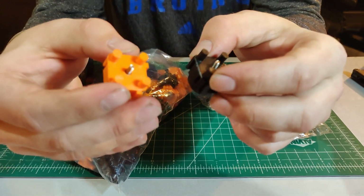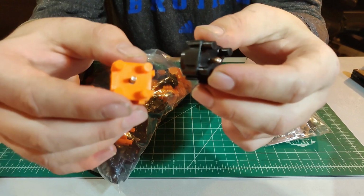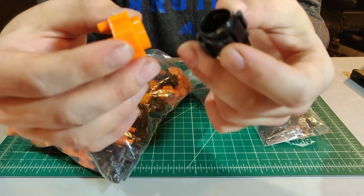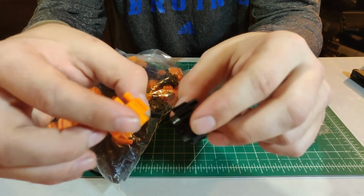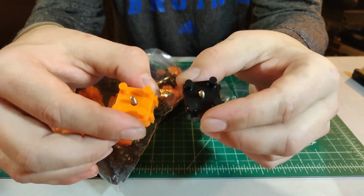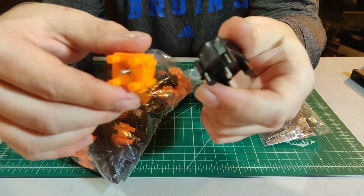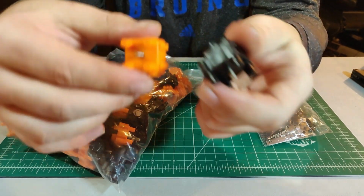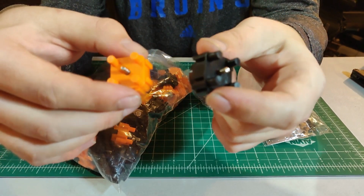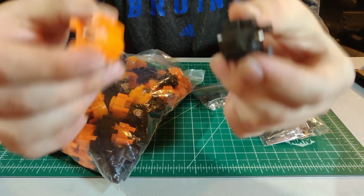The nice thing about this method is you can remove it easily and there's no residue and there's no permanence, so you don't have to spot weld your batteries together to make a pack. There is a limited amount of current you can put through these before you are going to want to switch to spot welding your batteries, but that means that you can carry spare batteries with you and swap them in and out of the pack, which is a really nice feature if you have a lot of cells and you want to take the drone out camping for a few days and you just don't have the resources to recharge all the batteries, you can just take them with you.